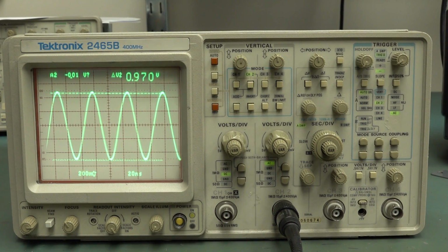We kind of got a bit lucky on this one just by replacing a few unregulated side electrolytic caps on this, as well as there's some X and Y class safety caps, which in this case hadn't failed, but they could spectacularly explode at a moment's notice. And it has come good. There you go. So much for scrap and no trace on this thing. It was a simple power supply, but it looks like somebody's had a shot at this because some of those capacitors looked like they had been hand soldered and replaced. So yeah, I'm not sure what's going on there, but look, we're on our way.